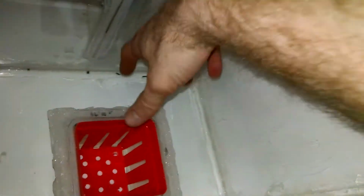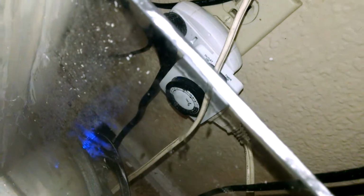So basically, to make all of this, I used the dremel, even to cut the plexiglass, even this thick sheet right here. This thick sheet is a 0.22, also the front, just because it's thicker and it won't flex for the viewing panel. Everything was cut with a reinforced blade for a dremel. This right here is a food container. I bought 2 just in case I messed up the first one. So that's what it looks like. It's pretty neat.